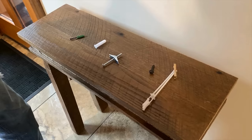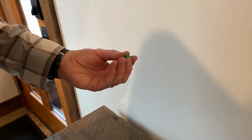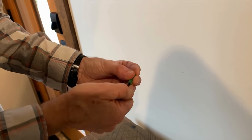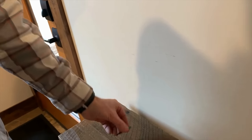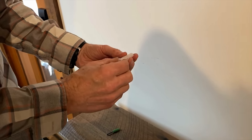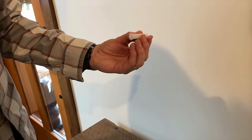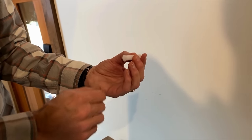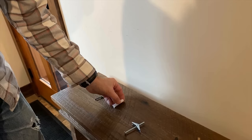Here's a variety of things you can put in a wall to hold a picture up. This simple version — you drill a little hole, tap it in, and a drywall screw holds your picture. But this is not very strong at all; it's strictly stuck into the drywall and is not really going to hold a picture or mirror as heavy as this. This next option is pretty strong — drill a hole, tap it in, and thread a coarse bolt into it, which holds really well. But even this is just holding into the drywall with nothing preventing it from pulling out. So that's not what I used on this particular picture.